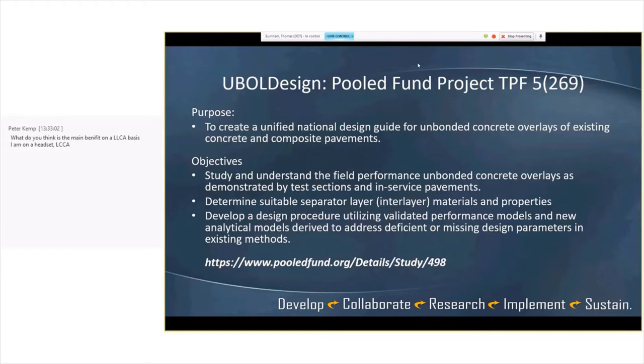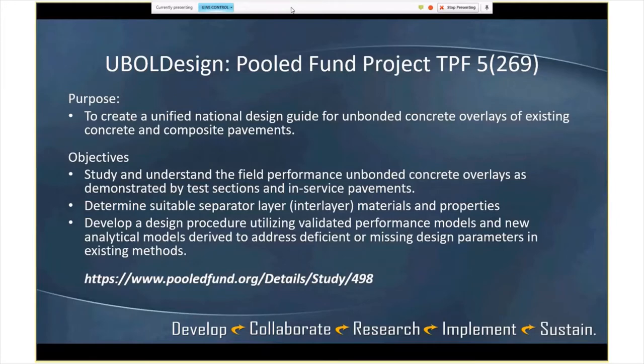So I think some states, I know Minnesota for sure, require a lifecycle cost analysis, but sometimes that's limited. I think the lifecycle cost analysis has to be global. If you have to put it in an urban section, you're looking at new curb and gutter, new New Jersey barrier potentially, and on a high-speed roadway, ramps and loop connections. So you're looking at some side impacts and potentially bridge clearances that should be included in your cost estimate.